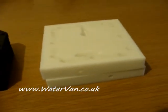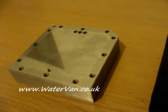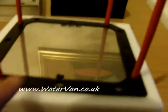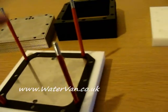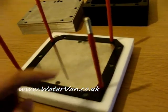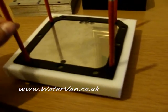I'm going to show you guys how I'm going to put it all together, so hopefully you'll be interested in making a similar system yourself. I've just begun building this cell up. I've already put one gasket between the end plate and that first steel plate, then another gasket on top. I'm only using four threaded rods at the moment, and I've wrapped electrical tape around them so they don't make contact with the plates at all — that should shield them.